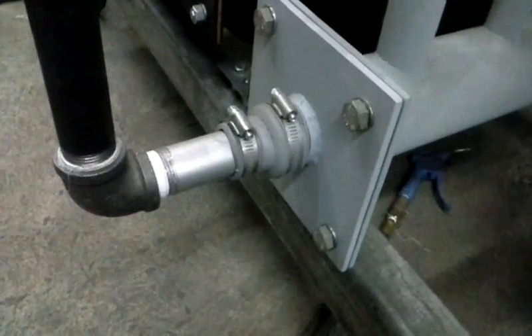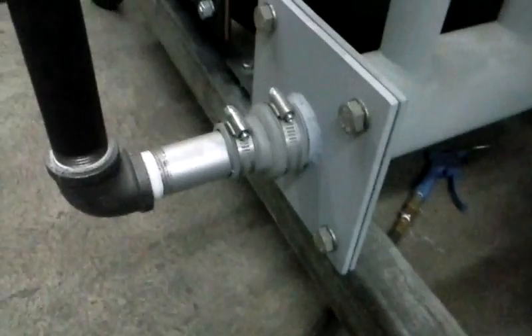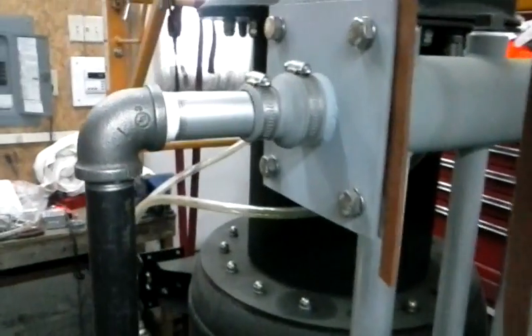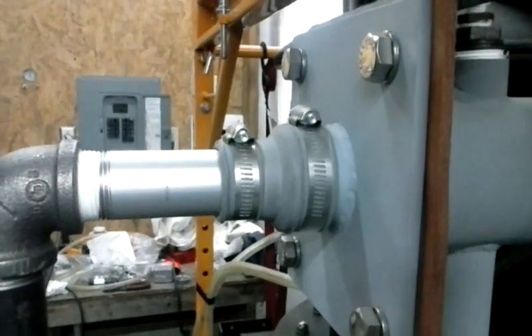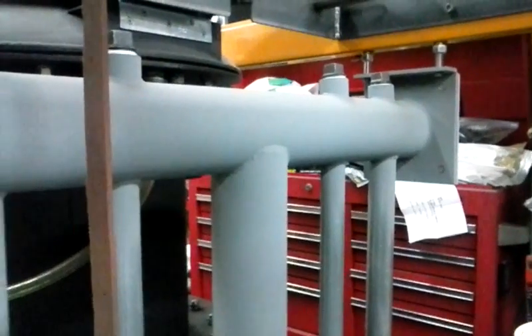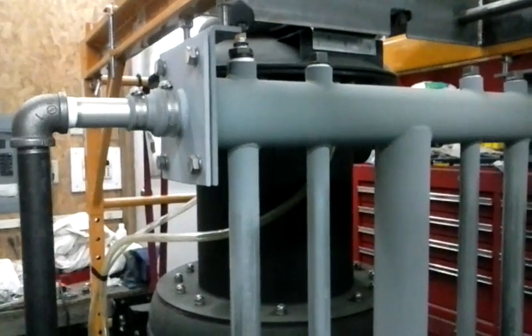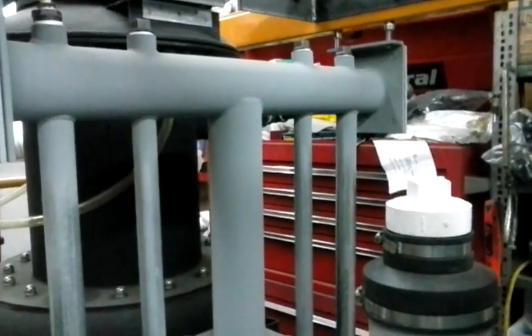This was actually an aluminum handrail from Home Depot — I think it was $35 for about an 8-foot length. I'm using it for my air intake and I have a Harbor Freight pipe threader that I threaded the ends with NPT, so it's all one-inch 90s back into steel, then 90s back into another aluminum pipe — same setup: rubber coupler, goes into the cap, sealing off anything from leaking out, and goes into the radiator. The hot gas coming out of the radiator travels up the pipe and slams right into that aluminum pipe, so two things are happening: you're transferring heat to your incoming air and you're also losing heat from the temperature of your gas. At the bottom of the radiator it goes into the expansion tank.